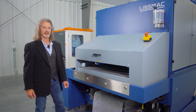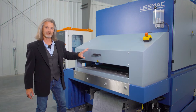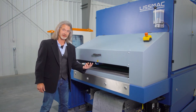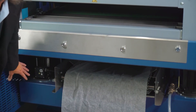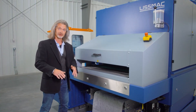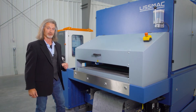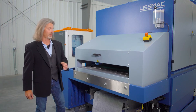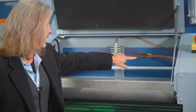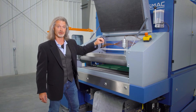The rear of the machine is the dryer area. On the SMW 5 Series, all machines come standard with three squeegee rollers on the top, three squeegee rollers on the bottom, and what we call dual air knives — two air knives on the top and two on the bottom. We also have two motors pumping water through the machine in a closed system where the water continually circulates, filters, and goes back into circulation. We also have a central lubrication system in the dryer area that allows you to lubricate from this point with pulls of a handle, instead of getting inside the machine to reach each individual point.